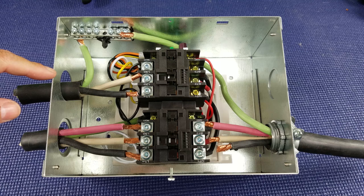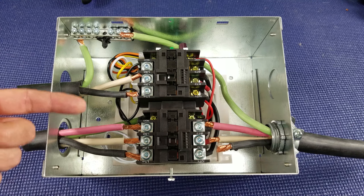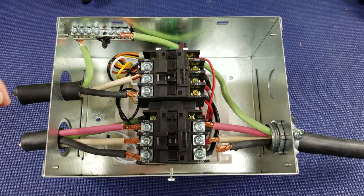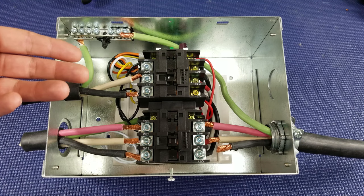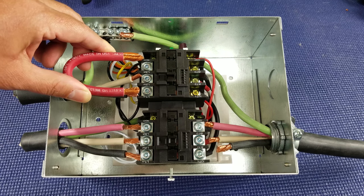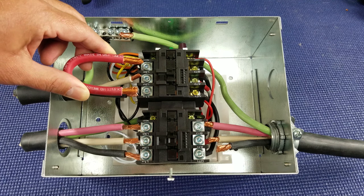Here's where your alternate power comes in. In my case, we're talking about an inverter which creates AC from 12-volt batteries. This is only 110 power — notice the wire colors have changed. We only have one leg of power: the black wire carries power in, we have the neutral, and we're missing that second leg that would make it 220. A trick I discussed with Go Power: to get both circuits lit up when using an inverter — essentially fooling the system into thinking you have 220 when it's really 110 on each leg — you jumper a cable from L1 over to L3. Now your distribution panel sees power on both legs. This is approved by Go Power's technical support and is a viable solution, giving you 110 power on both legs so everything in your RV lights up.